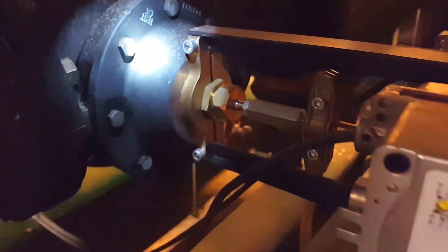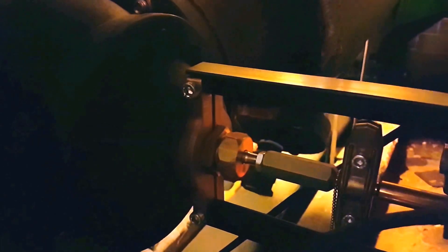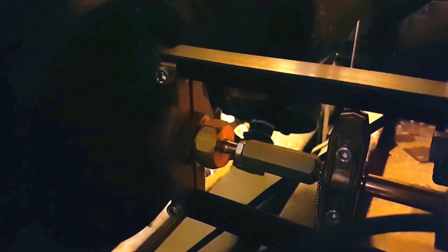These are a very reliable valve — this is just something that is commonly needed as part of the process, particularly when you install new valves. That slight weep is elevating the hot water temperature greatly — it's exceeding where it needs to be. Especially currently, we are in a warm period with lower demand for hot water, so it's only making the problem that much worse. You can hear a little bit of flow through there.